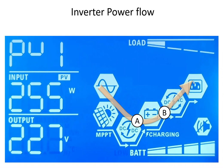You might hear the fans coming on, but it does its own thing and protects the battery — you have to do nothing. If the mains power falls away, you'll see that little hexagon disappear; it will take power from the battery and feed it to the loads. Say it does that for two hours and then power comes back — it will recognize the battery isn't full, control the current at point A to charge the battery while also feeding power to the loads, until the battery is fully charged. Then it returns to the mode where current at A and current at B are equal.